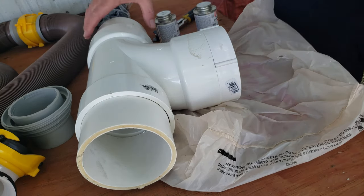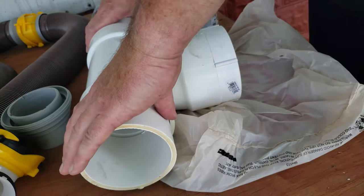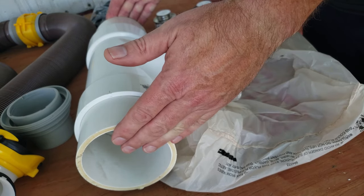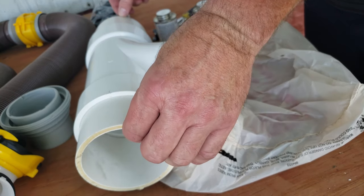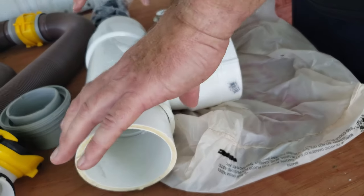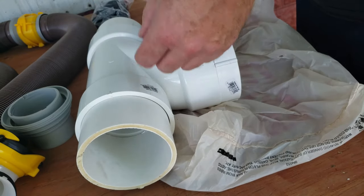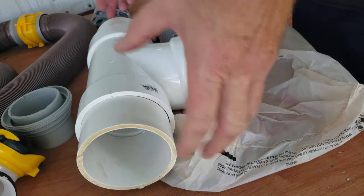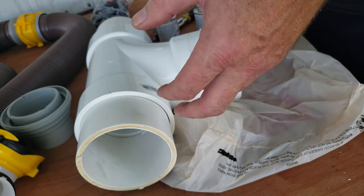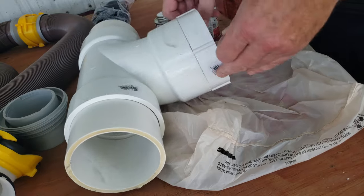The rubber connectors — or grommets, whatever you want to call them — slide on here. I'm going to cut a chunk out of my existing sewer pipe slightly larger than this so I can slide the rubber connectors on, place this in place, slide the rubber pieces back on, and tighten it. The cut ends are already shored up with bricks to hold it in place so it doesn't bow. We're good to go.